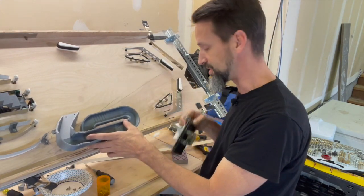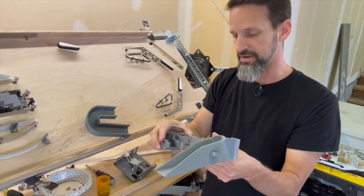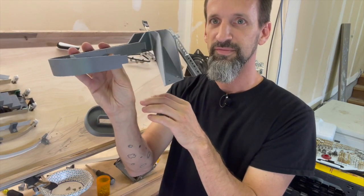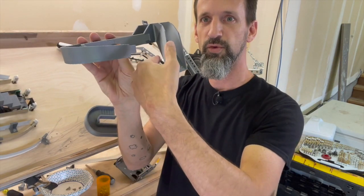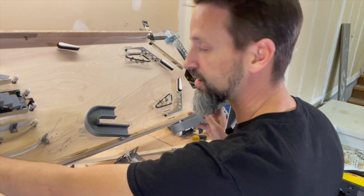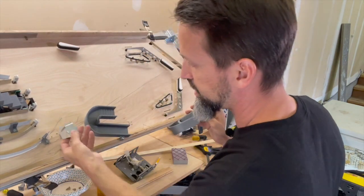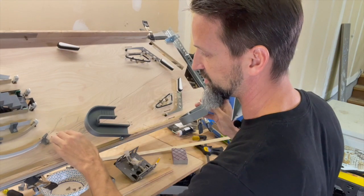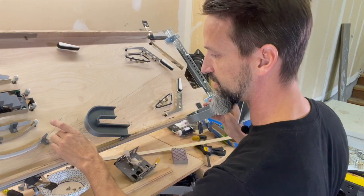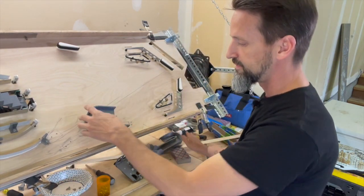And then in front of the drop targets, if you remember, we had that shot we wanted to make, where if you're looking towards the ramp on the playfield, we want to be able to have a shot come in right here underneath the ramp that's going to join over here into the orbit. So we need to put a control gate here, a one-way gate, at some point, depending on where that's going to be, to make sure the ball only goes one direction. When it comes back the other way, it's going to actually come down the orbit. That's where we want it to go. So I've been trying to go through and figure all that out.